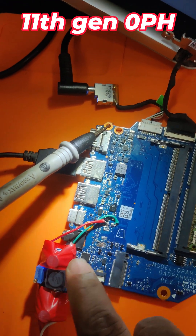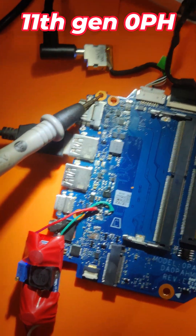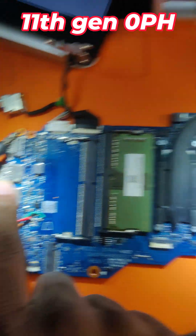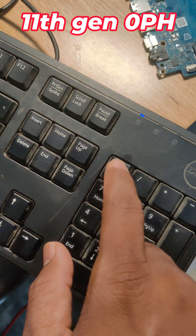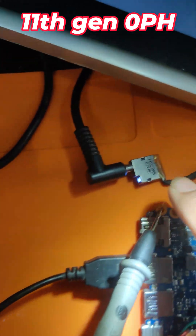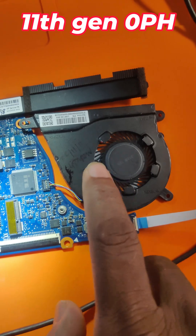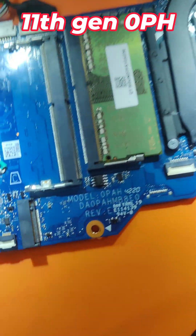I have given DC power supply - it's a converter IC. Usually what happens on this board: the keyboard was not working, the 5 volts also got completely shorted, there was no light, and the fan was also not spinning. This kind of problem will come usually on these motherboards.